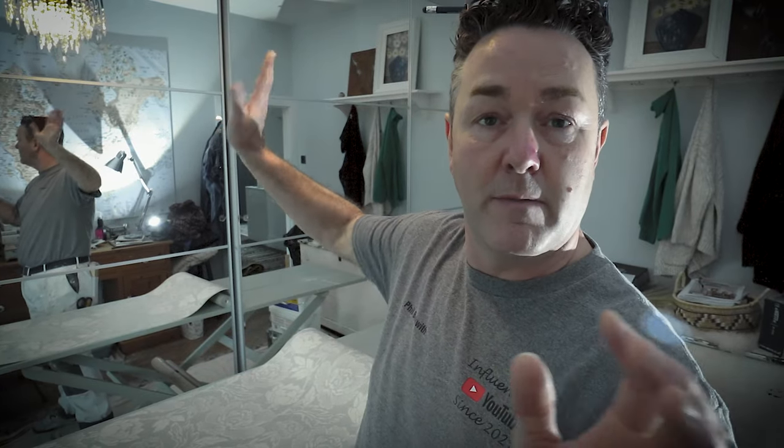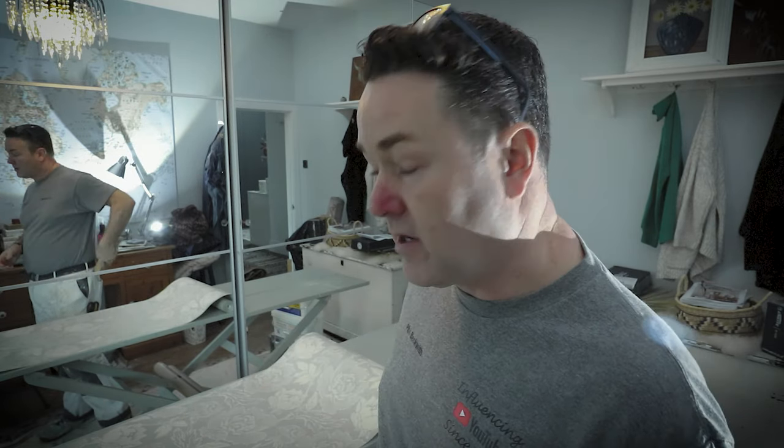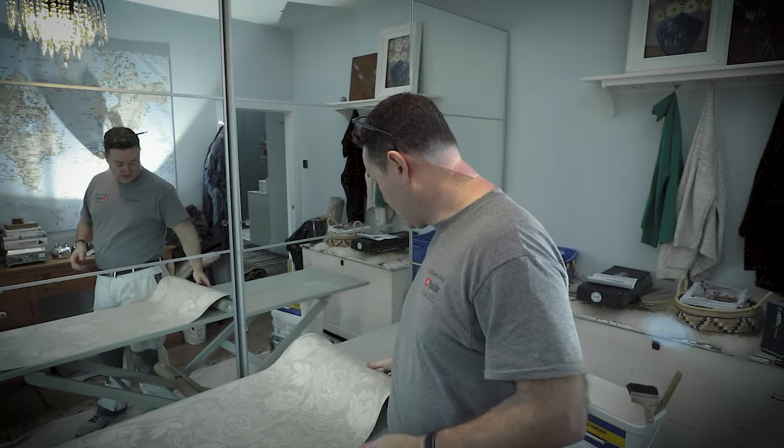I'm rolling it back on itself the other way around and I'll do that to each roll. Another consideration: Farrow and Ball wallpaper is handmade — it says make sure you've got a lined surface, which we have, and to hang it with a hanging brush rather than a spatula because you could polish up the surface. What's nice about Farrow and Ball papers is they're printed with their own paint colours, so colour matching is spot on.